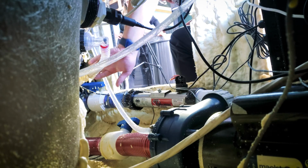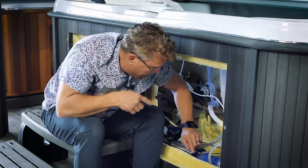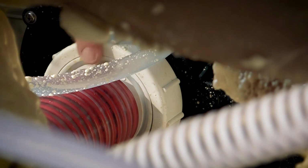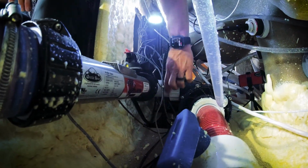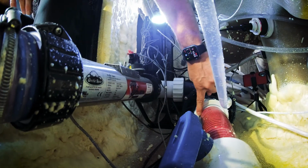And you can see some jet lines here. We use white hose, meaning the PVC inside the pipe is actually colored for color coding. So this suction side here, I could bleed it here. Technically I could even bleed it up here. This is where I'd typically bleed, or I'd bleed from this big one right here, the suction side.